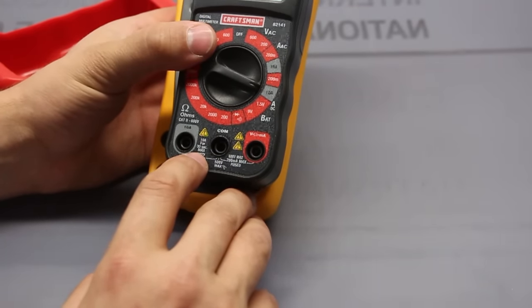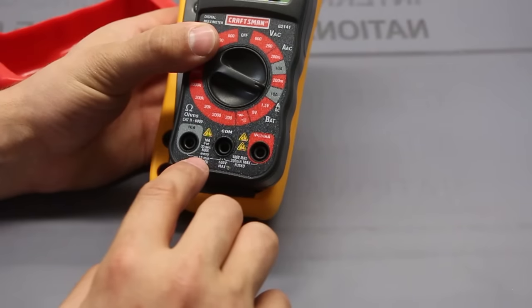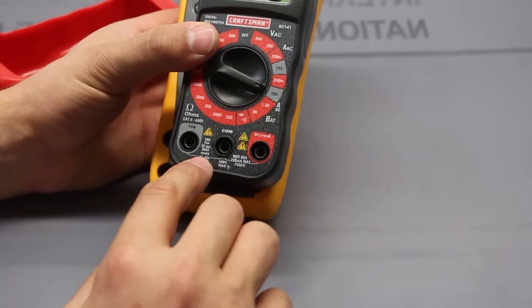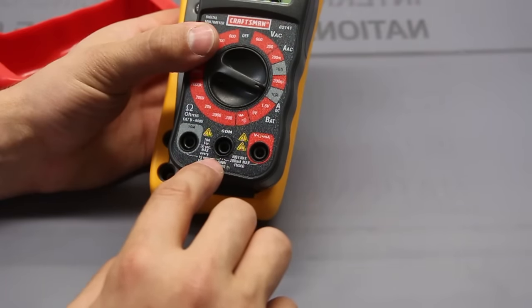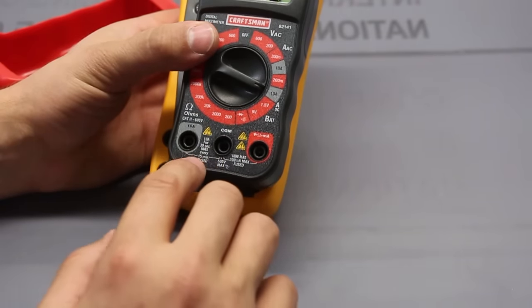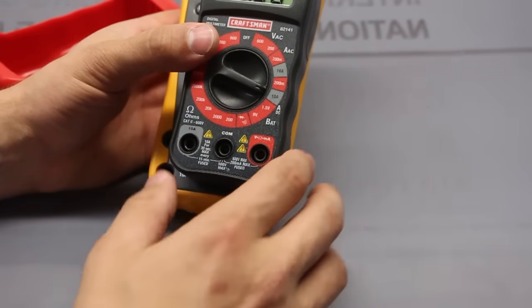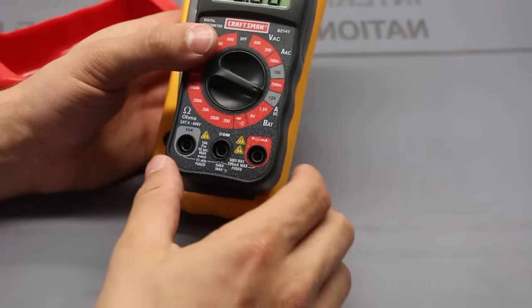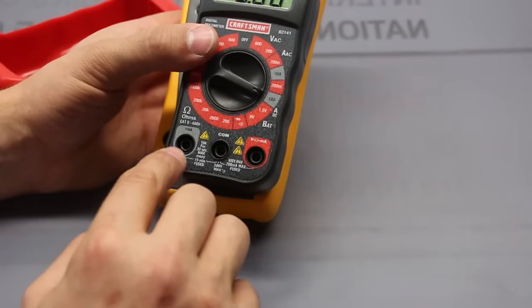And be very, very cautious about keeping consistent with these readings. This is 10 amps for 30 seconds max, okay? And this basically states that don't just continue to leave this measuring current and think that it's okay for a half hour. You're gonna blow this and potentially blow this entire thing just because it's cheap, and I'm not sure how much I would trust, really how much I would trust putting 10 amps in this. That is a lot of juice.